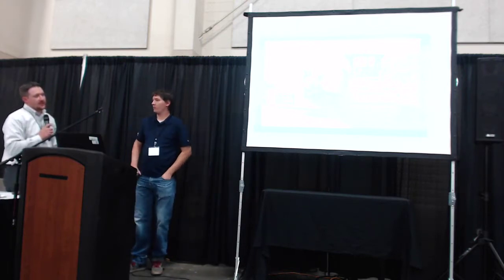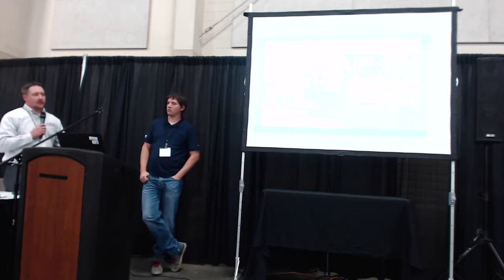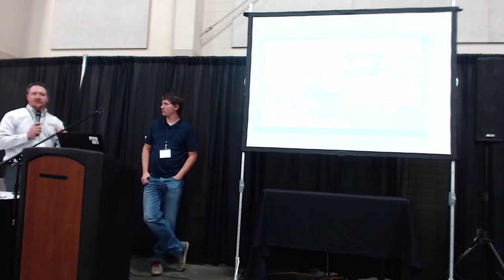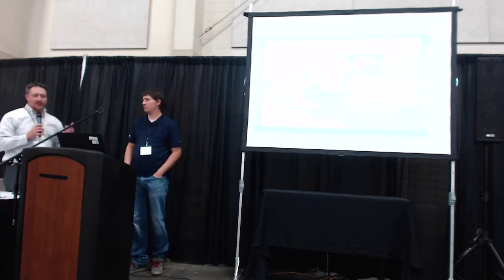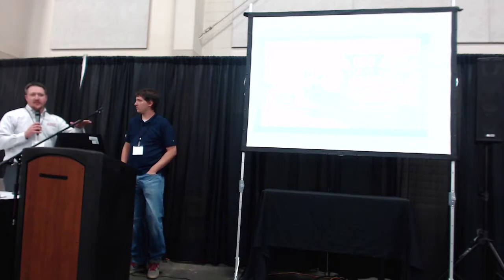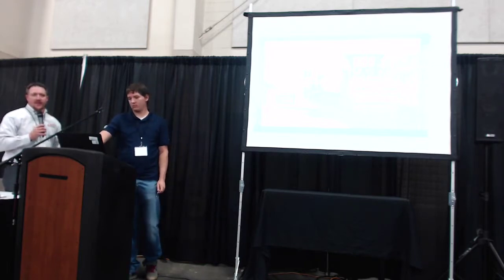Same thing. I see the breakdown rollers are usually pretty good about staying right up there. It's the intermediate, but mostly the finish roller that, if someone's going to fall behind, it's going to be one of those two. So just make sure that the QC technician and the roller hands are in constant communication. That's just the biggest problem that I've seen.